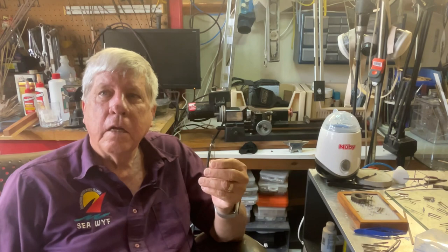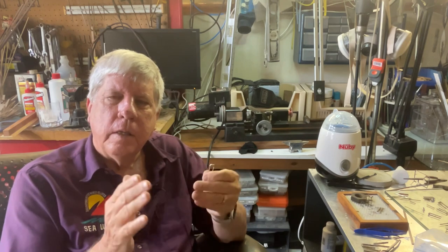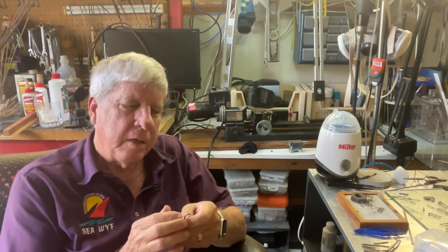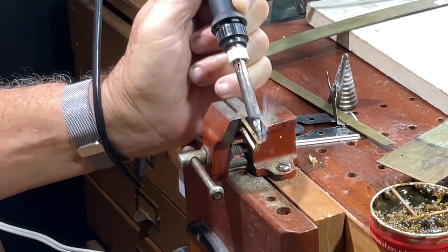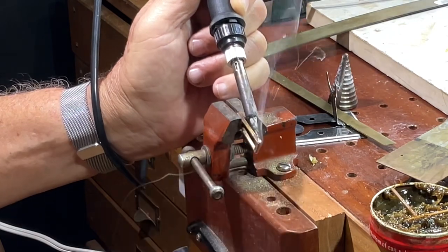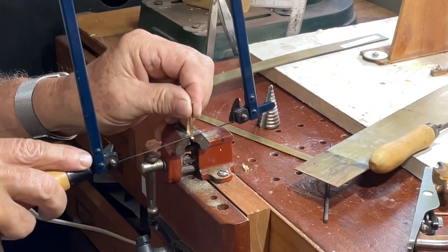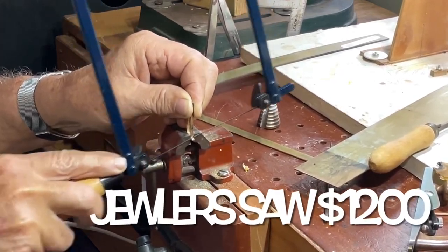In the case of this particular gudgeon, the solder didn't seal it properly. The silver solder doesn't fill gaps - it just joins two pieces that are close to one another. So I'm going to put some regular solder on it, which won't melt the original join, but does allow me to fill a gap if I need to. And then I'll sand it and clean that up. I'm using my regular flux, which works great with normal, very low, easy soldering. And once I get the gap filled, I cut off the extra pieces and then go and file and clean the whole piece up.